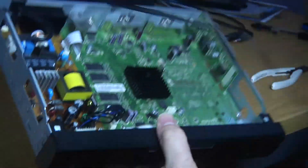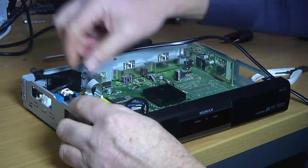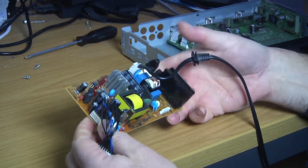They're 2,200 microfarads at 10 volts and 6,800 microfarads at 25 volts. They've just aged, so we're going to replace them. I'm not going to take you through the whole process of taking the thing apart — it's very obvious.